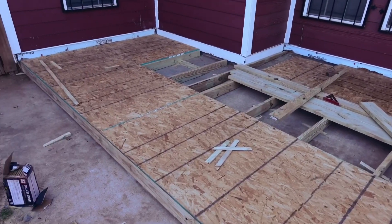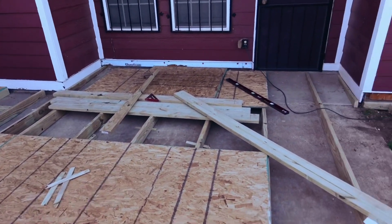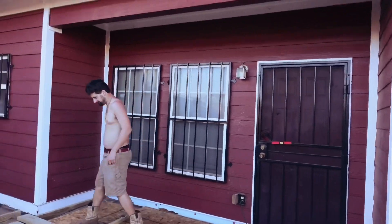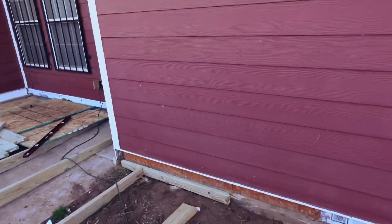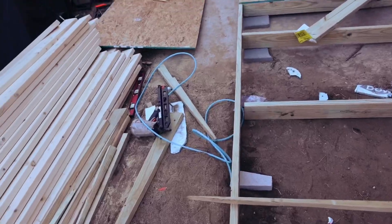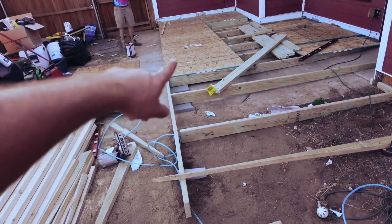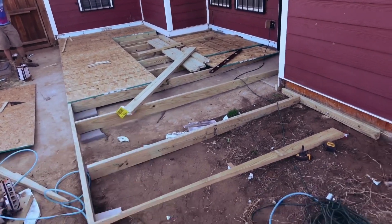If you're enjoying this video so far, make sure you hit the like button and let me know in the comments what you think. Alright, end of day one — we got all these joists run. It was hard figuring everything out. Justin's got no shirt on, not shaming anybody. We've got to get this thing straight — you can see it's bumping out a little right there, so we kick it into place. Now it's a lot straighter. I'm going to straighten it with a string line, and once you run your plywood it'll be dead straight.